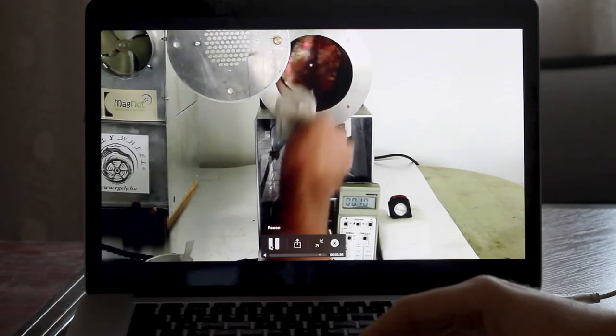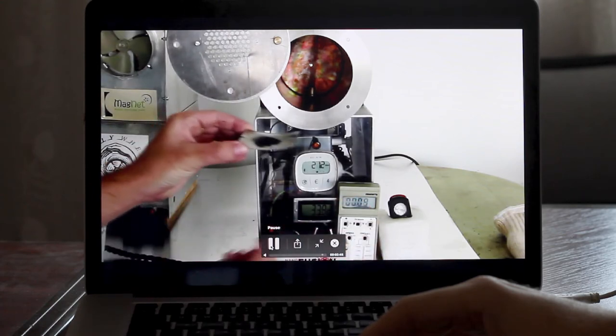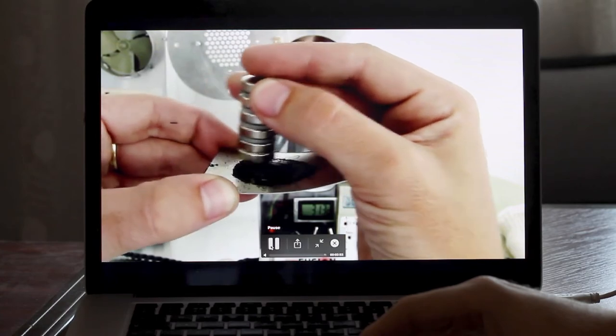No, the whole process is roughly 4 to 5 minutes, but it was cut to a shorter period. It's cooled down. And now the presence of iron is shown with this very small, very simple device. However, the iron was not the most interesting, but as I wrote in the paper, we have found aluminium and calcium and lots of other materials when we use pure carbon, high-grade carbon. For charcoal, we used only this for demonstration and for technological development. And what was the maximum sort of iron content? How do you measure it? A couple of percent, maybe. 1-2%.